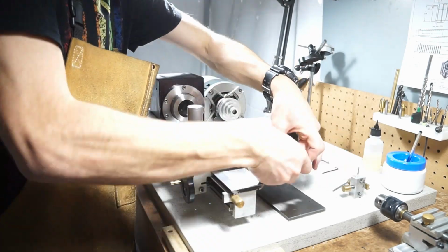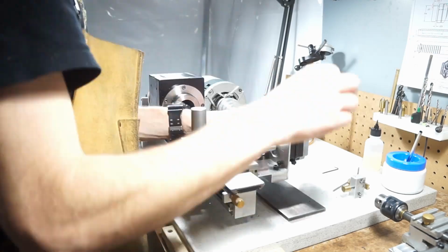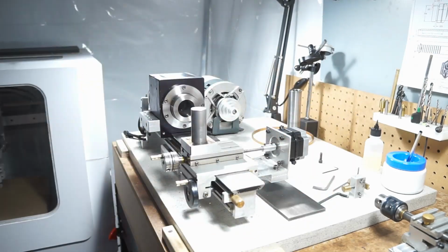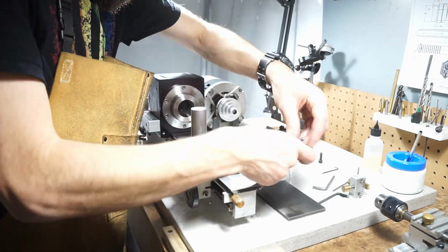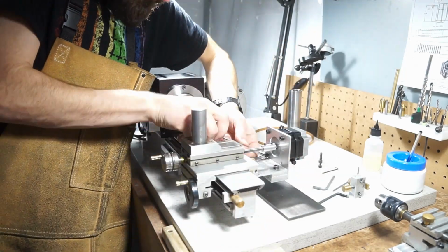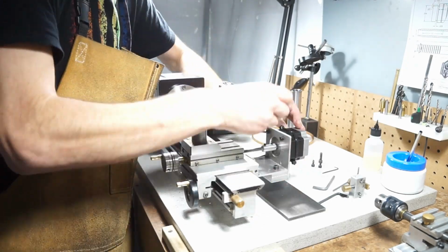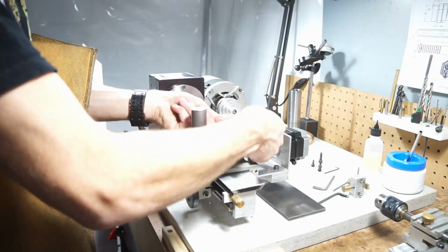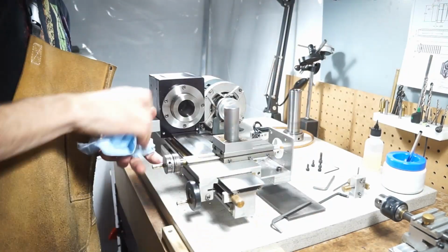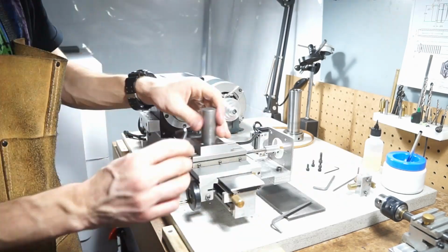The first thing I had to do though was get my lathe cleaned up and put in a few upgrades and modifications I wanted on it. With this machine, especially doing a lot more work in stainless and titanium, I'm using more abrasives during the final finishing steps. And abrasives you always want to keep away from precision surfaces. So normally I would cover the bed with cloths or shop towels while using the abrasives and then take the towels off, but it's getting tedious and annoying, so I figured a more permanent solution is in order.